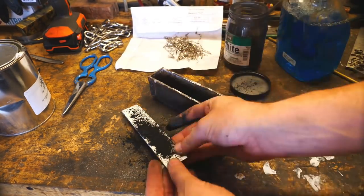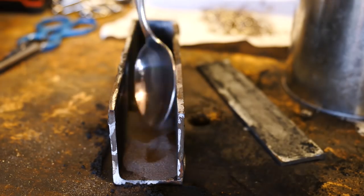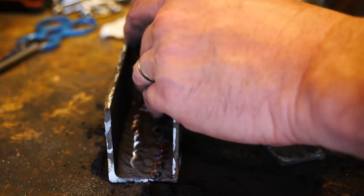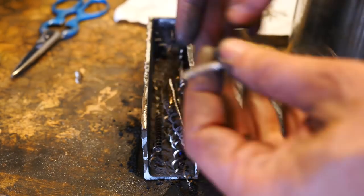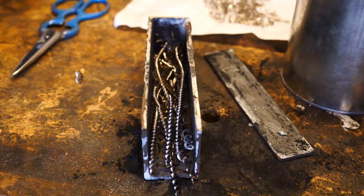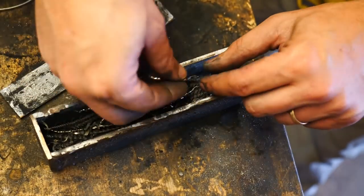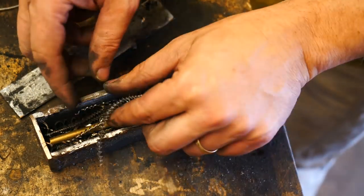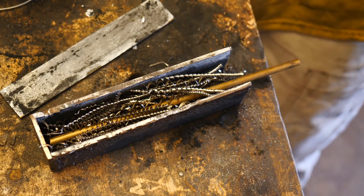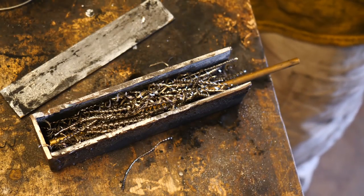This time we're also going to use liquid paper to line our canister in addition to some graphite powder. I got liquid paper by itself to work when making the fish hook canister Damascus knife about a year ago, but I've only had some rare success since then. Hopefully the addition of graphite powder will help, and I'll be able to peel away the canister when it's all forge welded. The spirals are laid out carefully, and I'm adding a hollow brass tube in the middle to add powdered steel while it's slowly withdrawn to help fill in gaps.